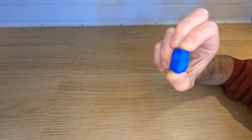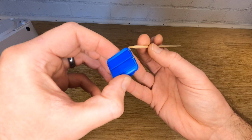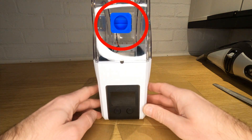The pins for the 20mm vent are the same but only 30mm long. Check that everything moves freely as you assemble. My pins were able to slide out so I dabbed a very small amount of contact adhesive on the ends — don't use any glue that's too thin because it will likely work its way into the mechanism and stop the vent from opening. This 20mm vent assembly is designed to push onto the inside of the right hand side cover or onto the vent mounting plate in the front of the lid. Wherever you fit it, make sure the blades are hanging down so they shut fully.